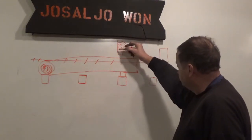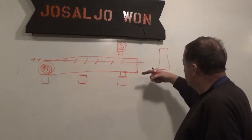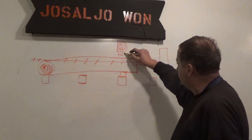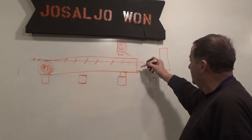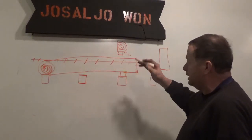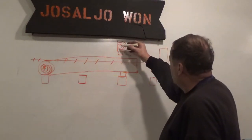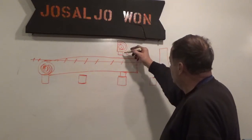So when you turn that, the center of the log is moving, okay? So you have to remeasure this to find out what you need there to be able to make a level and nice straight cut, depending upon how you want to cut it. But my point is that when you turn away from this face, you need to adjust the toe board.